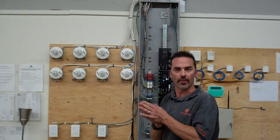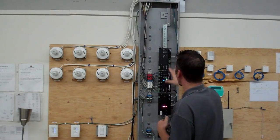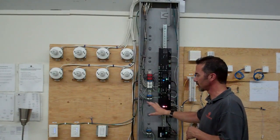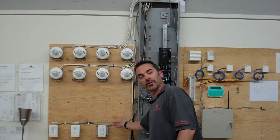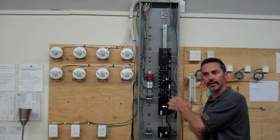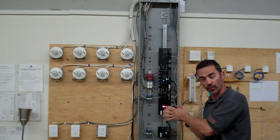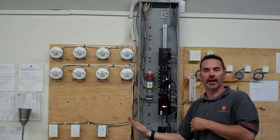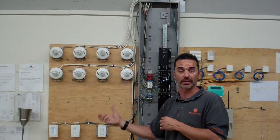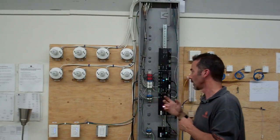We would take over from there, just so you know the final steps. We're going to be doing all the programming of these loads to all of the low voltage keypads. We're going to be running our low voltage wires to all of these keypads. We would ask you to put in these boxes at the locations specified in the electrical plans. However, where there are going to be low voltage keypads, we ask that you leave those boxes empty for us to put in our wires.